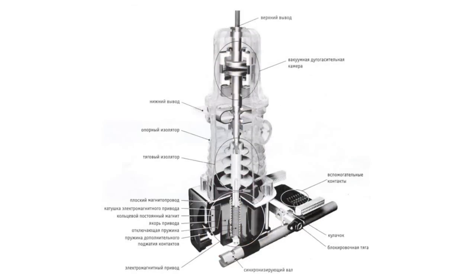The plasma generated by the ionized metal vapors conducts electric current, which is why the current flows between contacts until it passes through zero. When the current passes through zero, the arc goes off and the remaining metal vapors immediately condense on the surface of the contacts and other parts of the blowout chamber, restoring the electric strength of the vacuum space.